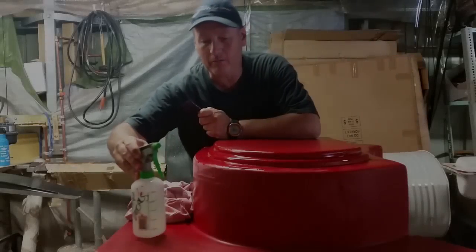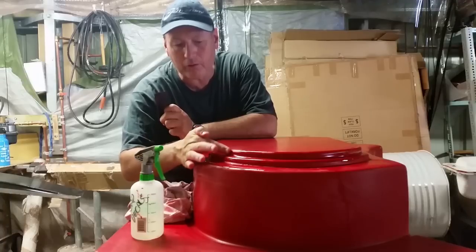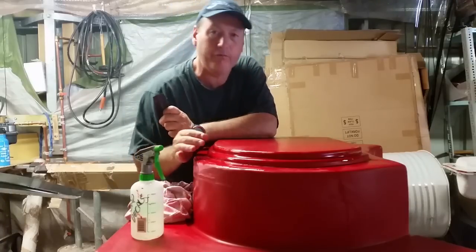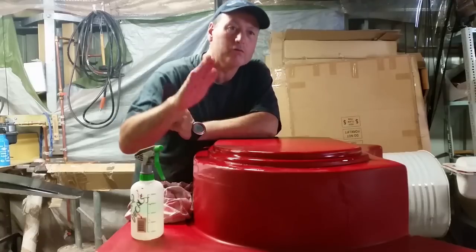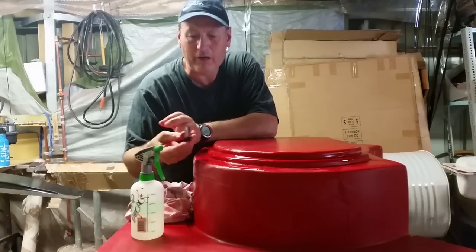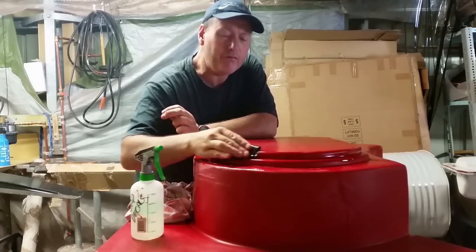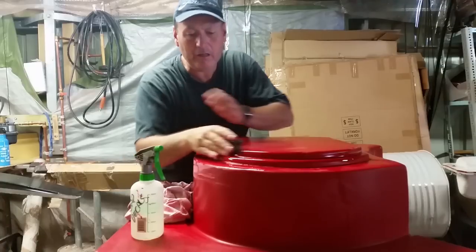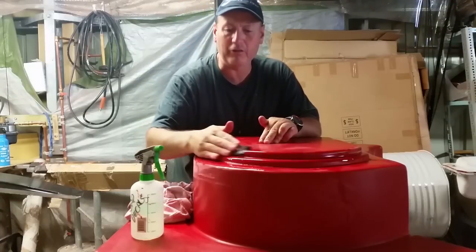Important with moulds where you've got the release angles, you've got these beautiful little radiuses. You don't want to be sanding them flat because you might reintroduce something that makes it hard for the mould to release. So a nice way of doing that is to just round up your paper and lightly sand. You'll notice I'm only using fingertip pressure here, and most would advise not using your fingers at all.